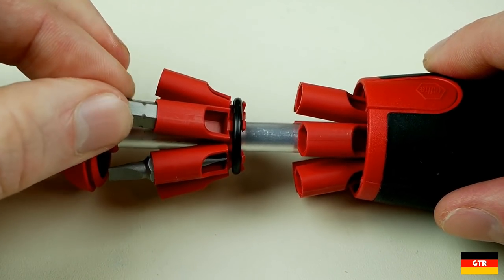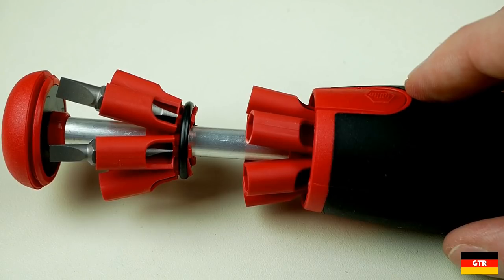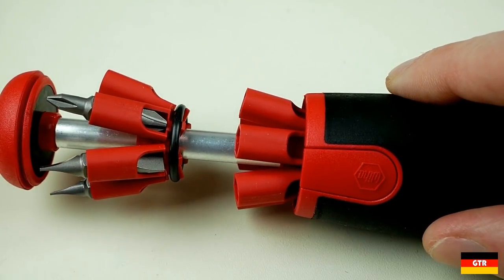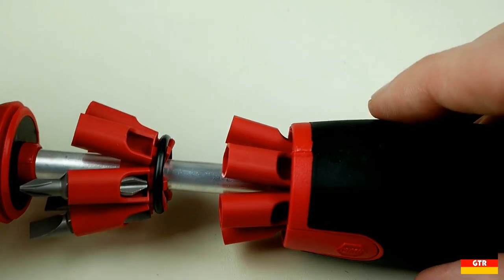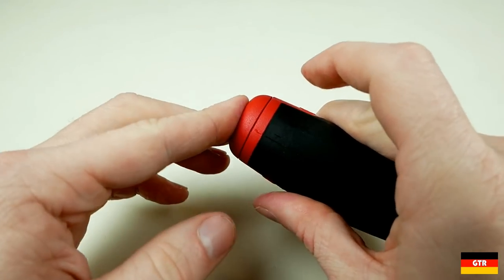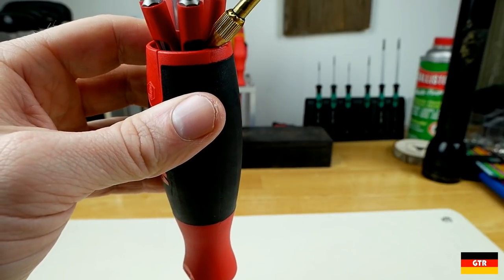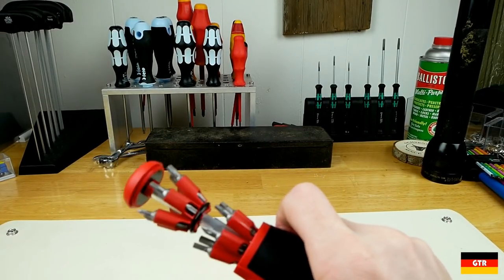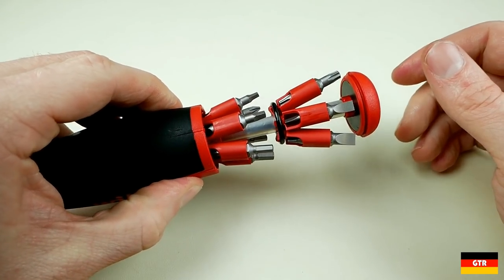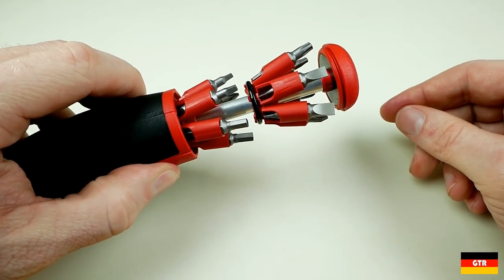I did notice that each of these holders is only attached with a plastic hinge that is part of the same mold for each of the six holders. At some point these would wear out from continuous opening and closing, but I think only VEHA really knows how many cycles it would take — I'm guessing it's probably in the tens of thousands, so I really don't see any issue unless you're using this set every day for decades. The pop-out carousels are spring-loaded with dual latches at the end of the handle. The first couple of times opening and closing it seemed a bit sluggish, so I added a little bit of oil and now it opens quite smooth and quick. I didn't see any desiccant packs in the box, so this could be from moisture building up on the springs, though I didn't see any evidence of rust or corrosion. Adding a small desiccant pack might be something that VEHA needs to do in the future if they start getting reports of corroded parts out of the box.